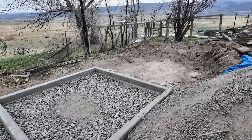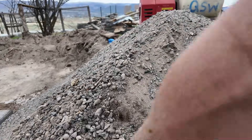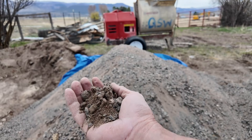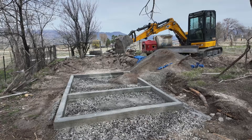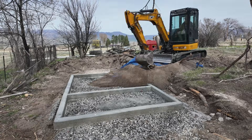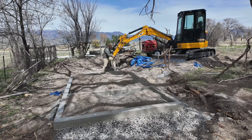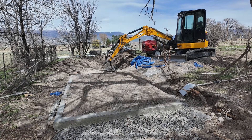This pile of material is three-quarter road base — gravel, sand, and just a little bit of clay. Stefano loaded that into the bond beam and then went through with a plate compactor. You want to have about five inches minimum of this road base underneath an earthen floor — it makes the perfect substrate, very stable once compacted with a plate compactor. And there we have it — we're ready for framing, so tune into the next episode and check that out.